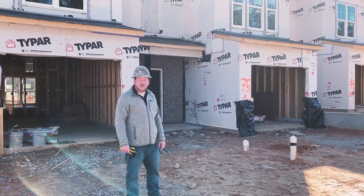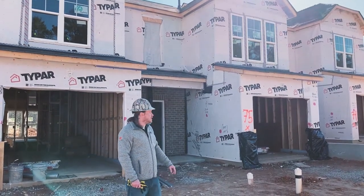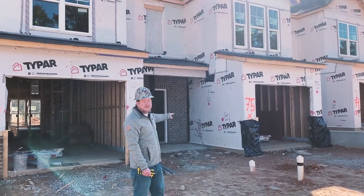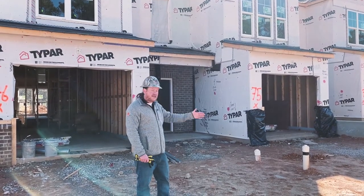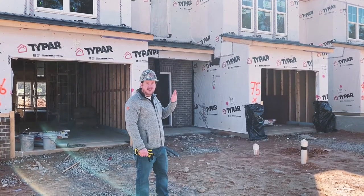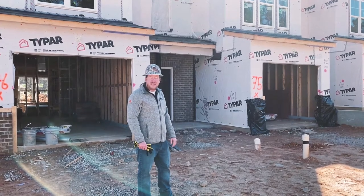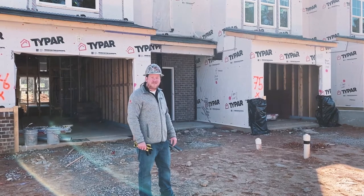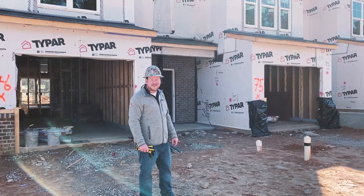I hope these five tips will help you get a tighter townhome. Remember: we need to make sure that we're sealing our vertical edges of the party wall. Don't forget about your band joist because that's a major weak area. We're going to seal the top plates behind the drywall to make sure we've got a good air seal at the top and bottom of that wall. We're going to compartmentalize with vertical and horizontal spacers, and then make sure that we seal the drywall itself to the framing to get a good seal at the top and bottom plates. Redundancy is okay in air sealing — use lots of caulk and foam to get them tighter. If you can't handle it, give us a call and maybe we can help you out with some air sealing service. Thanks.